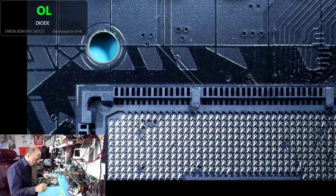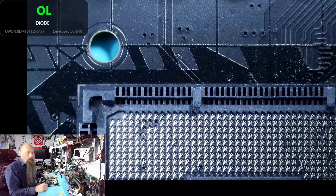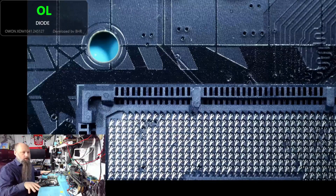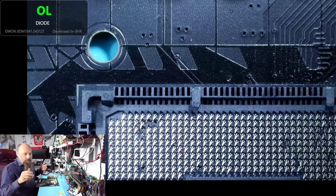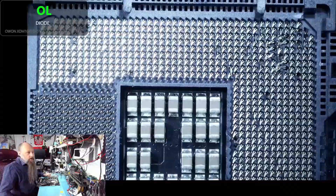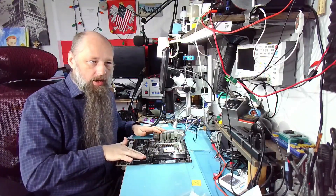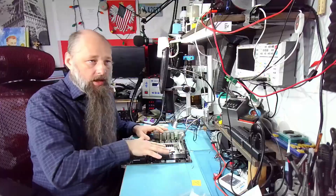I had a message from one of the jobs we did recently. The board doesn't post, but the CPU is not getting hot, which is very unusual. My understanding is that for the v-core to not solder on, a whole bunch of pins would have to not solder — a ridiculous amount of pins — because the majority of the socket is grounded v-core, and just a few pins for memory and data rails and stuff like that. What the customer noticed is that when you press on the socket, it changes. That's usually what I say about the PCH — press on the PCH and see if there's a difference, because that means a crack under the PCH. But in this case, it looks like it's the CPU.